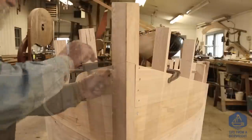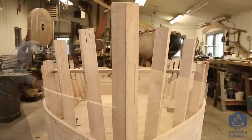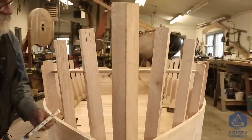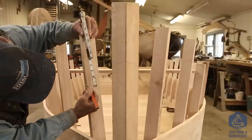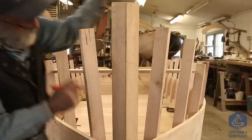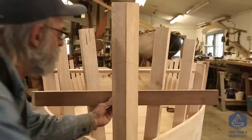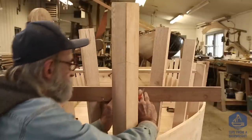I've got those two very forward shear planks back up in position and I'm going to mark the shear line that I cut into them on the bandsaw onto the frame heads with a pencil. Now that pencil line is just used for cutting those frame heads off to the right height. Now I'm going to remove the rest of the plank all the way to the transom. My intention here is to put a two and a half inch thick breast hook in it, so what I want to do is cut the forward two frames down by two and a half inches and the breast hook is going to sit right up on top of them.